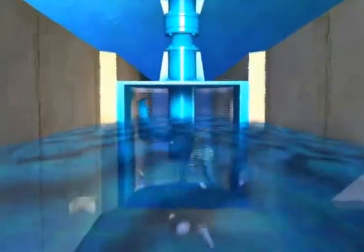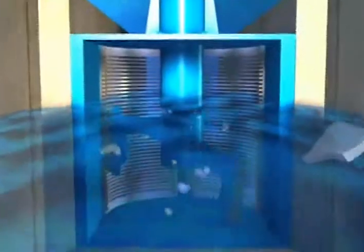The Diminuter aggressively reduces sewage solids into small particles with its heavy-duty design. Three rotary cutters mounted on three arms smoothly sweep oversized solids from a heavy semicircular sizing screen. When the rotary cutters intermesh at close clearances with vertically-mounted stationary cutters, the trapped solids are reduced into fine particles that can freely pass through the screen slots.